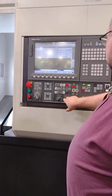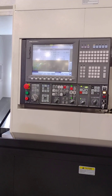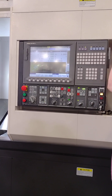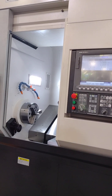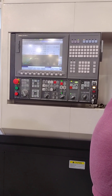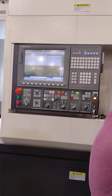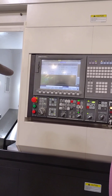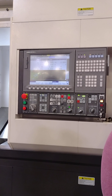So that takes us to these — rotating the turret, door open and close. The buttons don't do anything; that's for automatic doors. You have a loader up top, and you do have an automatic door. But you have to go with M codes. M291 and M290 — you might want to write that down. When you first start off the machine, you're going to have an alarm up here that says open door. M291 and M290.